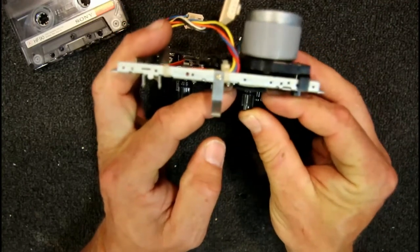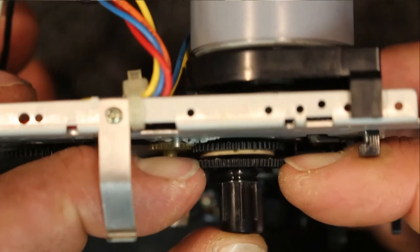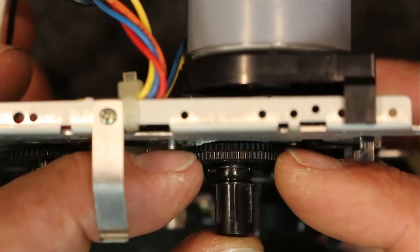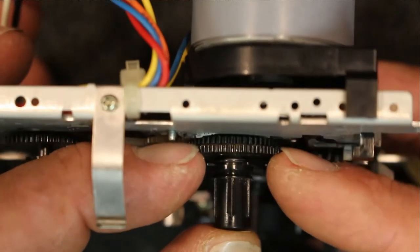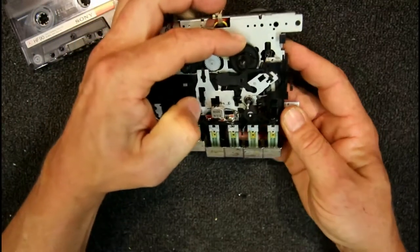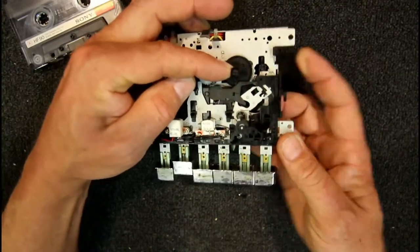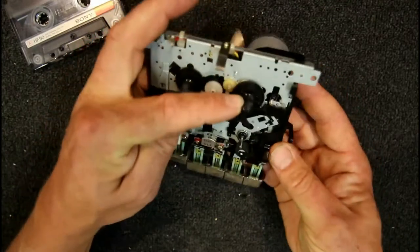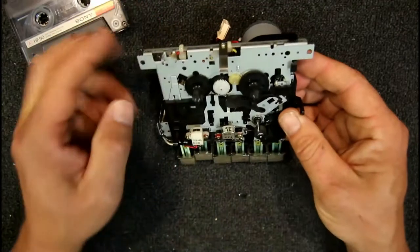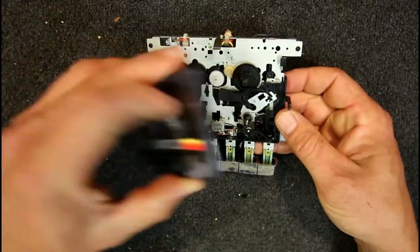There are actually two gears stacked on top of each other here. Pulling the upper gear out, there's some white felt under there. There's a spring between the sprocket part and the upper gear, which pushes it against a felt pad and a lower gear. So if I put it back in play and turn the capstan, even though I can't stop the top gear, if I hold the actual sprocket part that goes up into the tape, you actually get slippage — it stops turning while the upper gear keeps running.